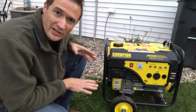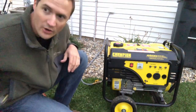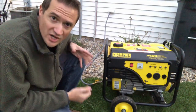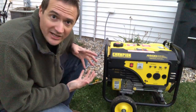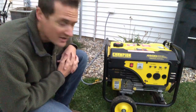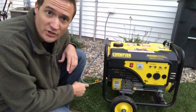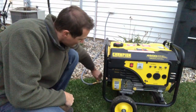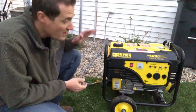If you notice, it's running a little rough at the beginning, but it'll smooth out pretty quickly. I can now hook up my quick disconnect for the house to keep it powered during an outage. And if we have an extended outage — like an ice storm — and we can't get gasoline, I don't have to worry because natural gas pipes directly to my house. I'm going to prove it's only running on natural gas by shutting off the disconnect valve right here — that shuts off the natural gas coming into the unit.